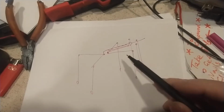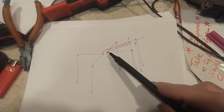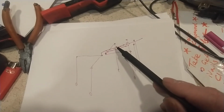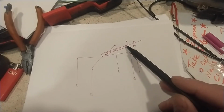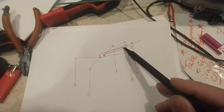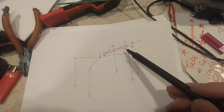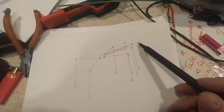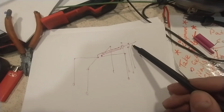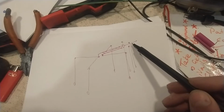Instead of, like the original video, having coax feeding to here, I have a parallel feed, so 2 parallel wires running at exactly a half wave in free space from the feed along the boom, and then at that point connecting to some coax and continuing along the boom. The coax feed is also measured out to be a half a wave, but with a 0.66 velocity factor.